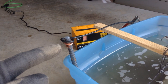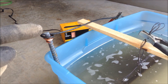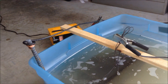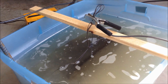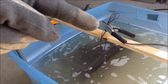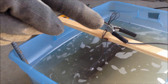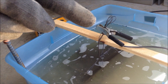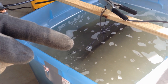Whether you use two, three, or four of these rebar electrodes, they need to be connected all in series together with a piece of copper wire. Do not allow that copper wire to go down into the water. In the middle, we have regular steel bailing wire — do not use anything galvanized. It needs to be completely stripped solid steel or metal, and that is wrapped around the cast iron.